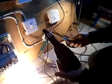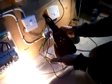Seeing that the circuit is okay now, I'll show you how it detects a fault at any point. First of all we'll try reversing the polarity just with the probes, not with the circuit. So we put the neutral on the live and the live on the neutral. Now it's flashing two reds at the bottom, one green at the top, saying that there is a fault and it's live and neutral reversed. So we know that works fine.